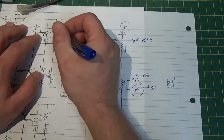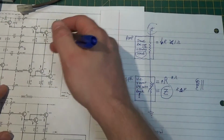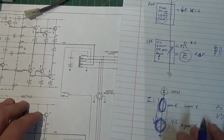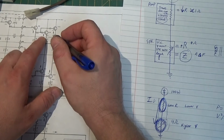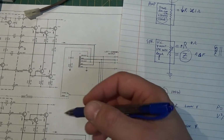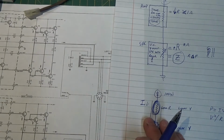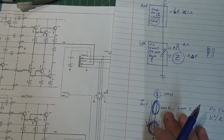Okay, so it's hard on the semiconductors, and you're also getting some losses. Okay, so even though an amp may be able to handle the 4 ohm versus the 8 ohm, it's harder on the amplifier. Chances are you're probably going to run the risk of getting more distortion, possibly, by running this at a higher temperature. So it's overall not a balanced circuit.